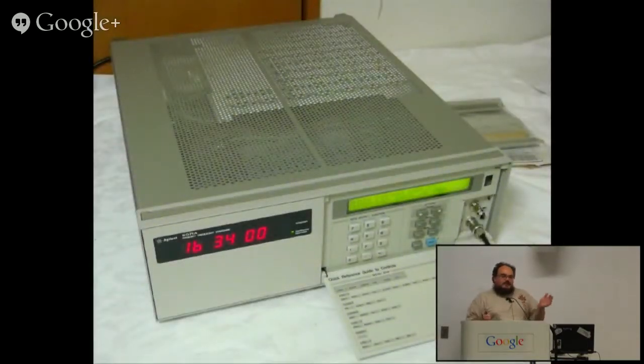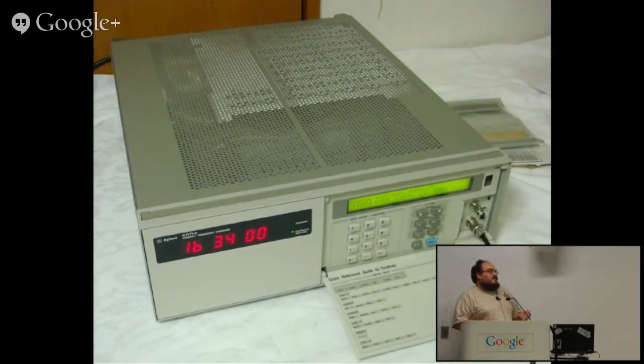So rubidium is a form of atomic clock. Time is actually defined by the hyperfine, I think third, cesium transition. Anyway, the cesium atom has a transition state when excited, and it essentially has a resonant frequency at about 9.2 gigahertz. Measuring that frequency, and in fact the number of transitions a second, is the definition of a second. So in a very real sense, a fully working cesium clock, by definition, is correct. That's not strictly true because, of course, you can never get a perfect implementation.